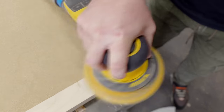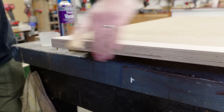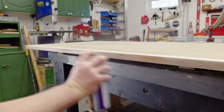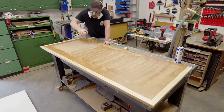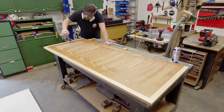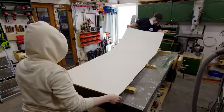After that I gave it a light sanding just to make sure it's all nice and flush, and I can also clean up those birch ply edges. I thought I was being clever by finishing the edges using a spray varnish prior to fitting the vinyl, but it wasn't a good idea — mainly because when you apply the spray adhesive it tends to get onto the edges as well, meaning I had to sand them down again and then refinish them afterwards.